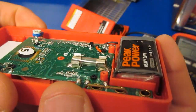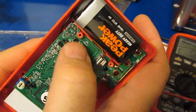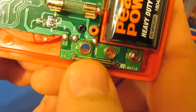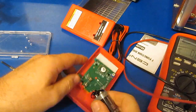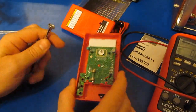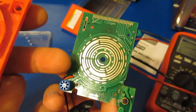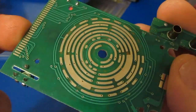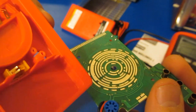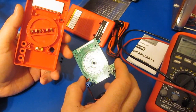This is a nicer one. It looks like the last ones I purchased had a small bead-type fuse located horizontally, but this one actually has a socket. Also look at the quality where they mounted these two circuit boards together — this is definitely a better looking meter than what I normally run. One thing I'd like to show you is that this meter has no grease on the contacts whatsoever. I have seen some meters where it looks like they use a silicone grease right on the contacts themselves, but I'm not sure why some companies use it in some cases.